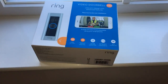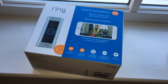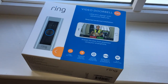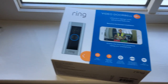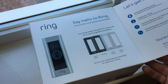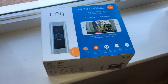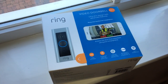There is a difference, and the reason is because the Ring Pro requires a constant power source of 16 volts or greater. That in itself is a problem with UK legacy doorbells that this is designed to replace. Those of you in other regions probably won't have this, but certainly in the UK and I think Europe as well, you will need this transformer.